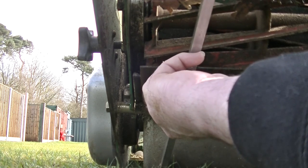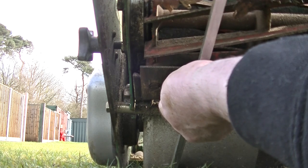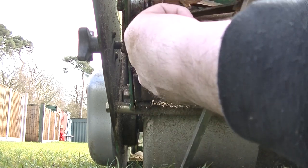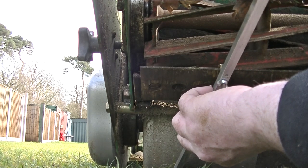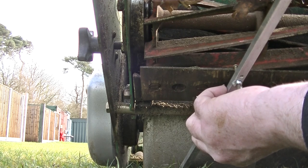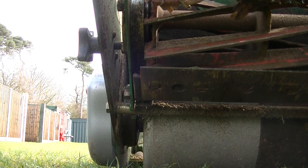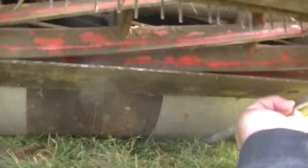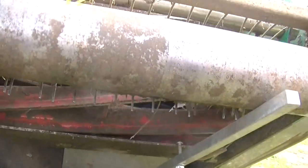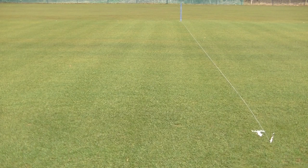So: one, two, three, four — that's one millimetre. One, two, three, four — that's two. One, two, three, four — now that goes on properly. There's very little play there. You don't want to tighten it too much or you will bend it, which makes it pointless. But we've got a good fit there. I'm happy that that's at 14mm. We'll check it in the middle — yep, that's good. And we check it again. We've got a good fit there. I'm happy that's at 14 millimetres all the way across.